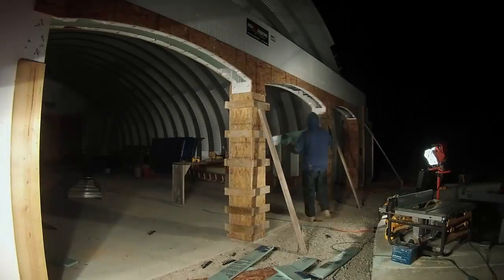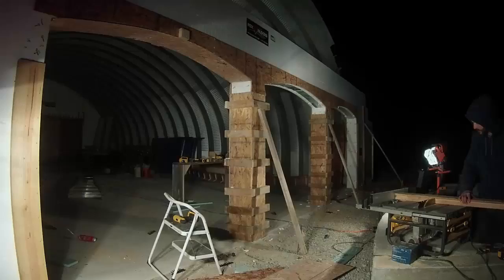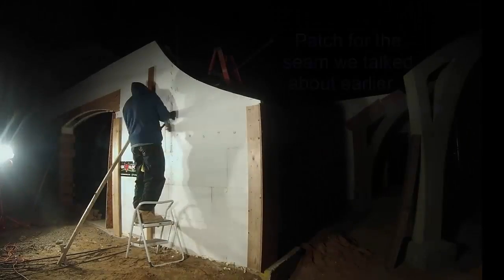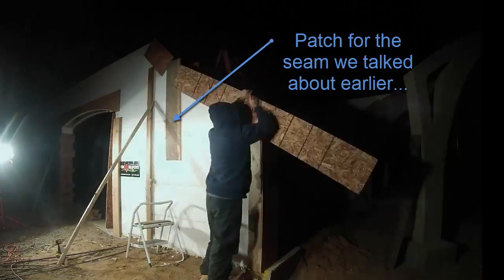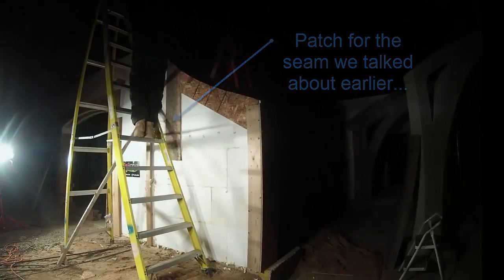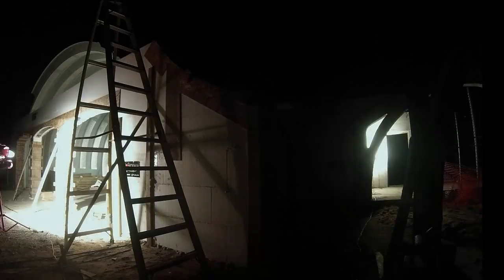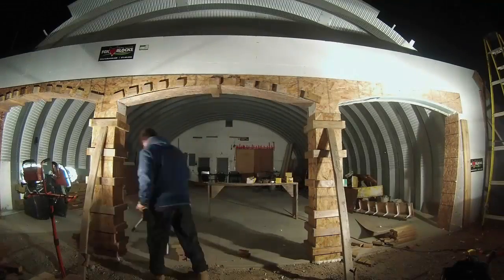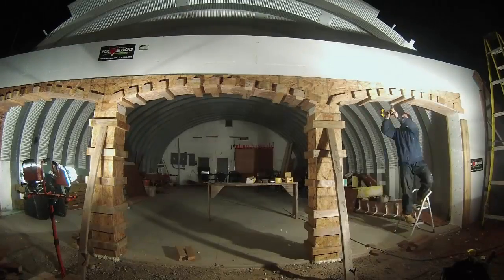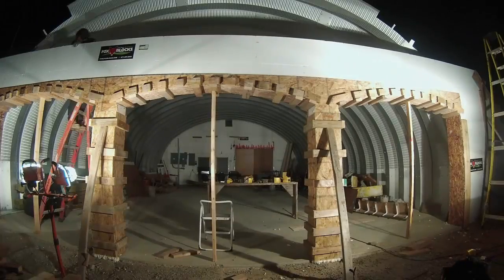Here you can see the cut arches, but I needed to patch the bottom side too. The first pour would put almost 1,000 pounds of wet concrete above each of these openings, so I had to do a good job. Similarly, I can't just leave these curved sides open — I needed to put sideboards on first in order to transfer and distribute the loads from the edges to the sides of the walls. Back again to the doors, and you can see the plan taking shape. Remember, 1,000 pounds of wet concrete per arch. I decided to add some support columns also.